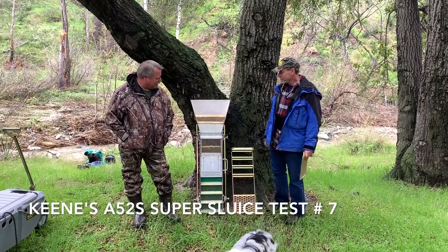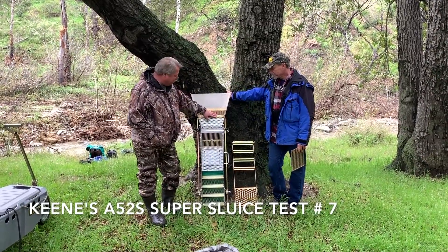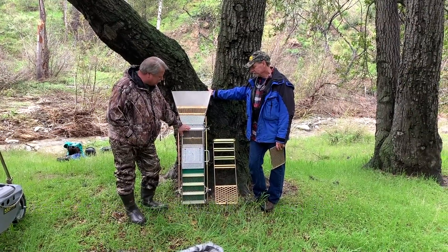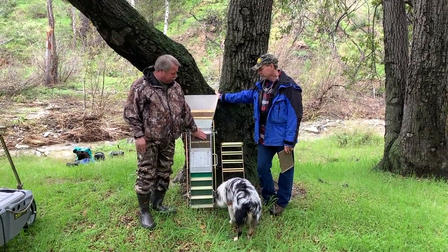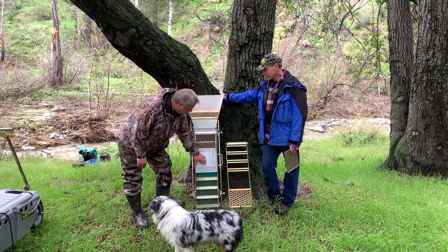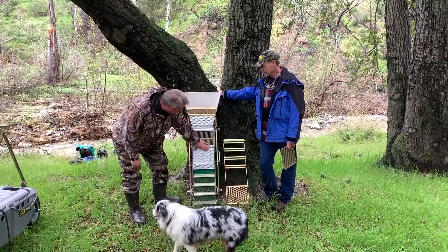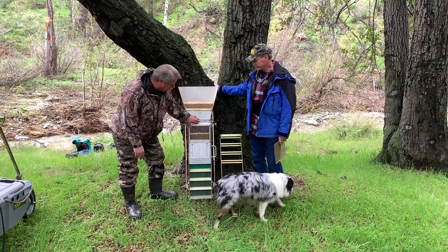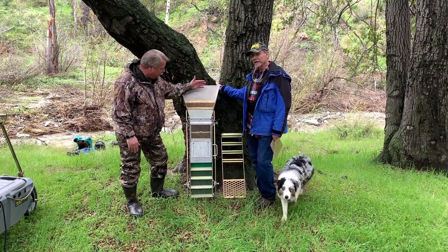We made more of a flat lift on our little grizzly bar ramp going up to the ramp that's also part of the punch plate. Right here as it hits this aluminum, we're hoping that creates a little bit of an eddy current to help force-feed the material through the grizzlies. With this punch plate you see here, we made it adjustable so we can open and close the aperture to control the water velocity a little bit.